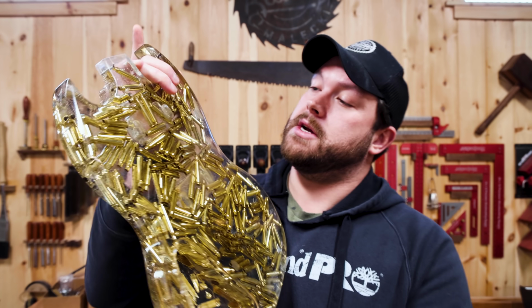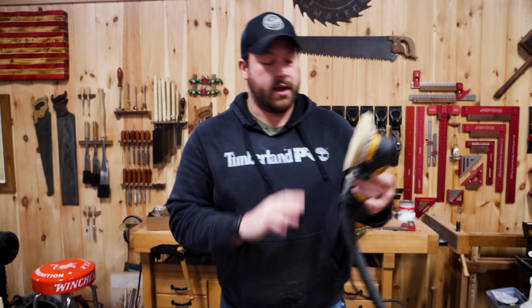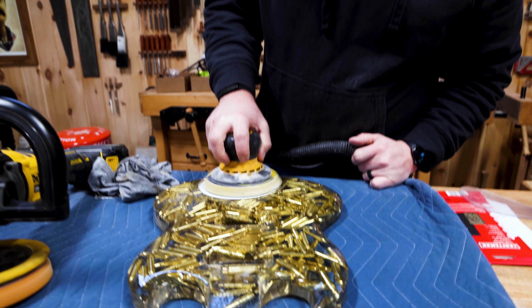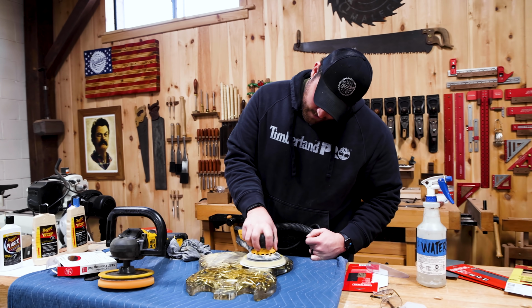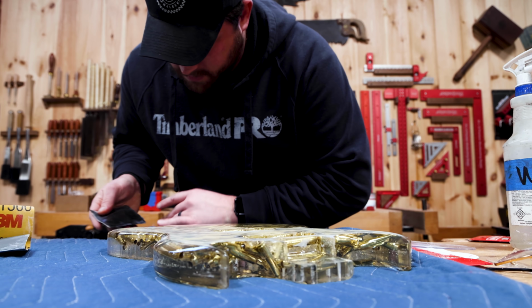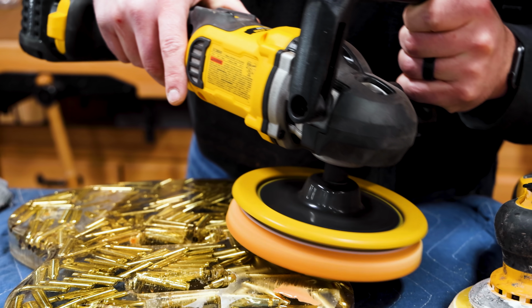So we're looking pretty damn good. We are out of finish. The back I already buffed up decently, and it's nice and flat and glass smooth. So we're gonna do the same thing on the front here, 320, and then hand wet sanding. Pucker up.